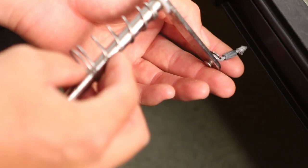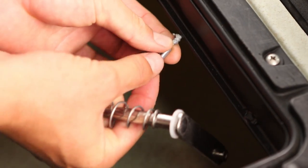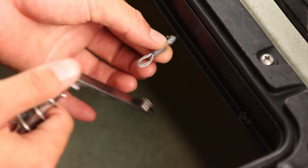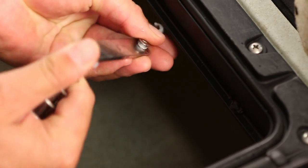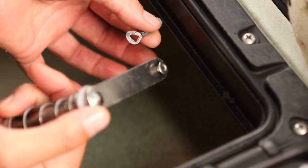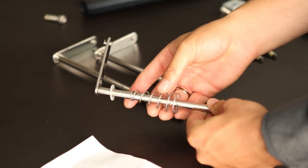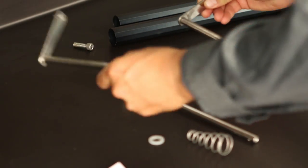This is what the crank looks like when it drops down from the top. There are two lines that have crimped loops at the end, and the loops are wrapped around this rivet. In order to pull the crank from the looped ends, all you need to do is release the loops right off the rivet. Here's the old crank — I'll need to keep the spring and the small washer, and our new cranks will be used.